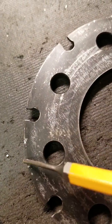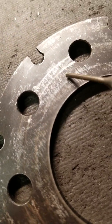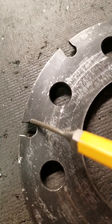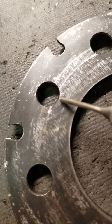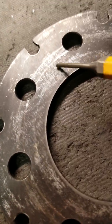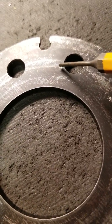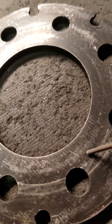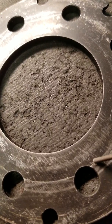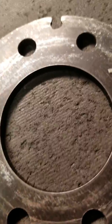Guys, you've got to set the plates right. No shell plate is going to work when you have your machine set up this poorly — with your swage dragging, missing the pocket entirely and dragging, and your pawl dragging so hard as to score the metal underneath it. If this wasn't a hard tool steel plate, this TNT plate — if this was a Dillon plate — I'm pretty sure that these marks would be deep gouges through that material. This is tool steel, but still, it's still raised. You can feel it. You can almost hear it, how hard that metal was scraped as it went through there.